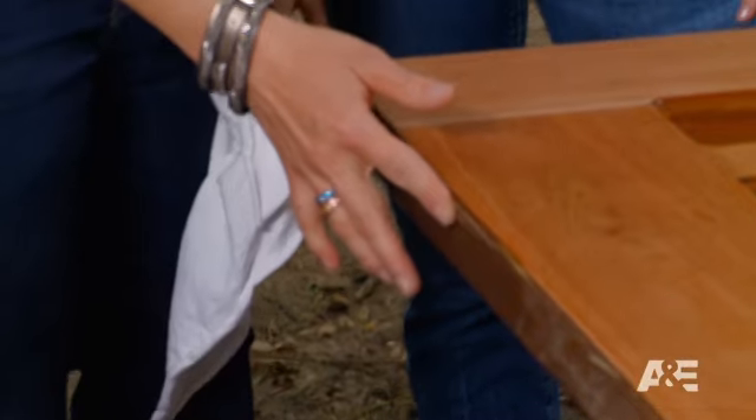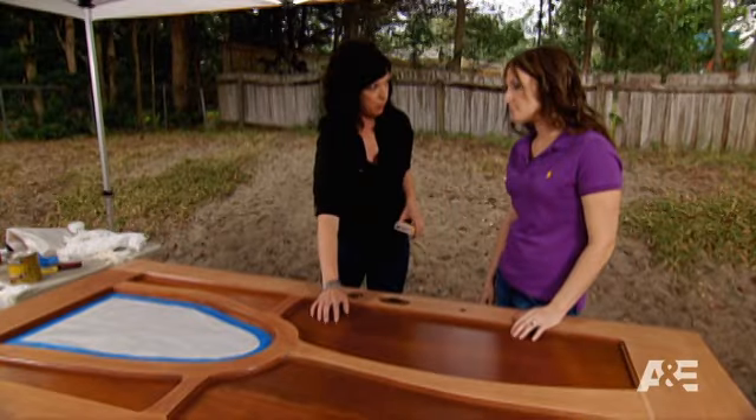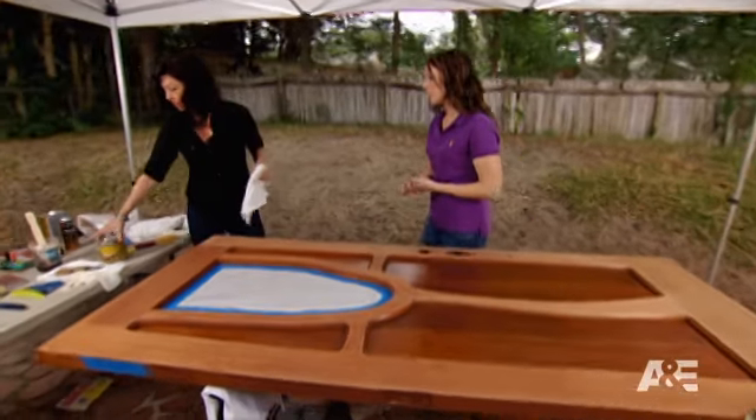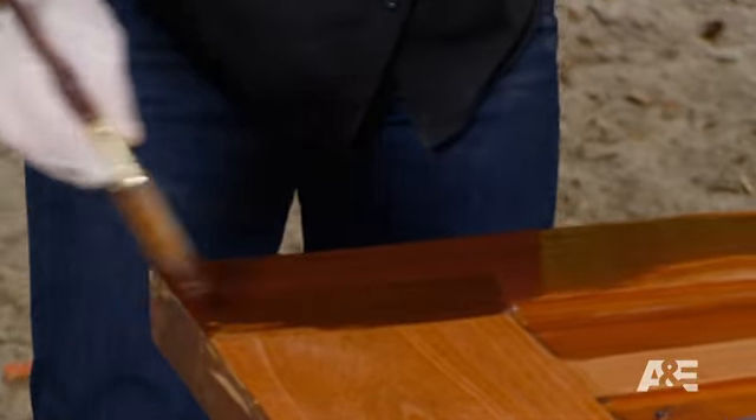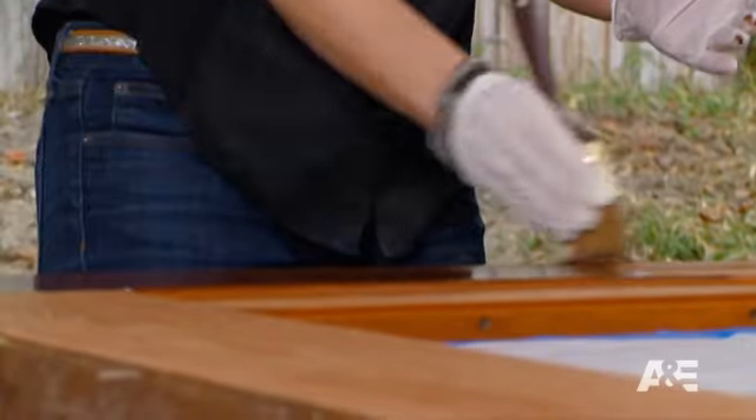What I'm going to try and do is match these to the interior panels. You want a nice, sort of even blended coat that penetrates the wood and doesn't sit on the surface. This is a brush-on stain. It's important to keep a wet edge — if you're brushing something on, don't let the end of it dry and then try to back-brush into it, because it'll get gluey, kind of goopy.